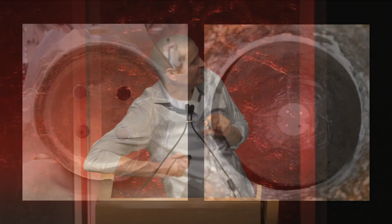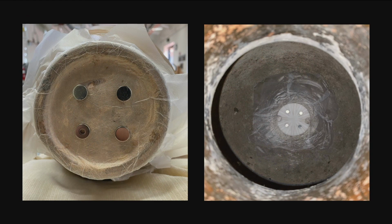Now, one of the things that was also mentioned by Stefan, of course, is the distance between magnets. The fact that here you have something in between, they are backed off of each other. There is a space in between. So you have to understand how much that affects the ideal pull force, and then significantly the density of the material that is in between. Both of those will directly impact how much pull force is actually endowed.